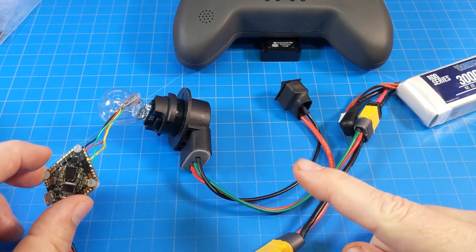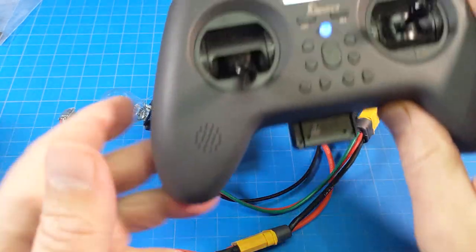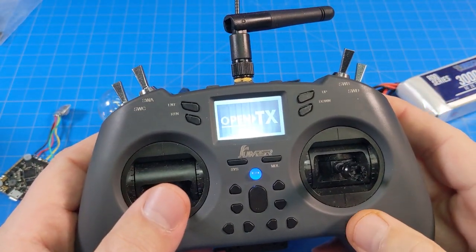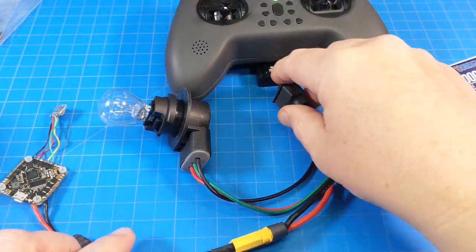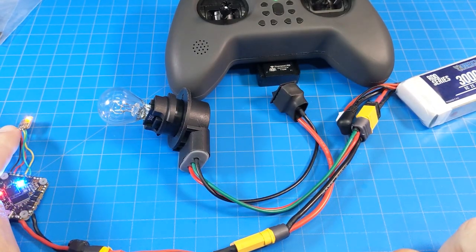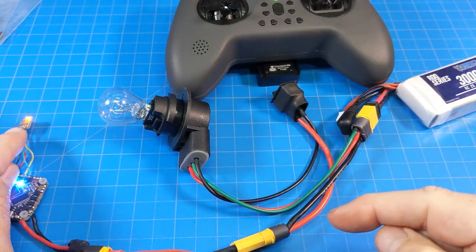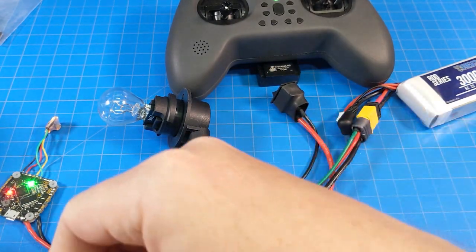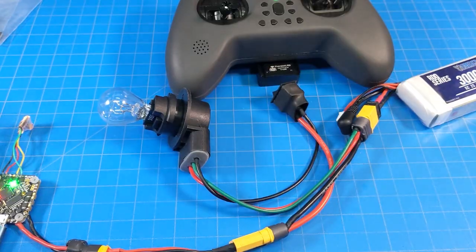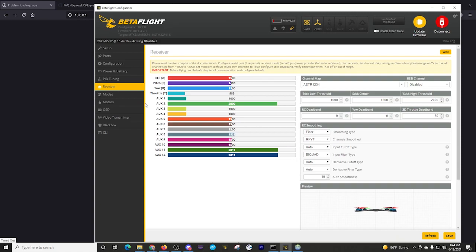On with the rest of the video. Because we've used the passphrase for binding, I should be able to just turn on my radio. Welcome to OpenTX — Amber tells me welcome. I get my warning, hit button. Without doing anything else, if I power this up, RSSI — hopefully you heard Amber say RSSI critical. I've got things pretty close together, but I've got a solid LED on our receiver, our EP2. I'm going to plug in the flight controller to USB and bring up Betaflight, go to the receiver tab, and you can see I'm getting all the proper movement on my receiver, even my three-position switch.